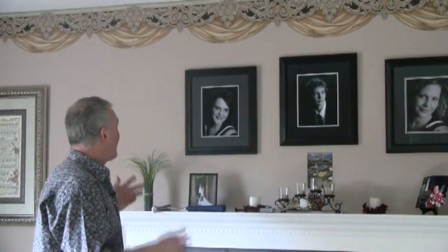When you're doing a set of 3 like you are here, it's a little more difficult. I'm going to show you a little trick to help you get these done right. What most people do when they're doing an arrangement like this is lay the pictures on the carpet or on the flooring. Figure out exactly how you want to have them all laid out. In this case, we decided to have them about 5 inches apart. The center one about an inch higher than the side ones.